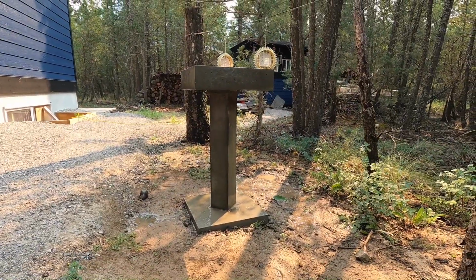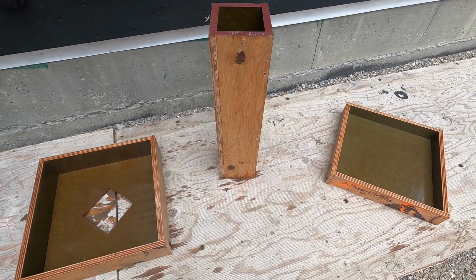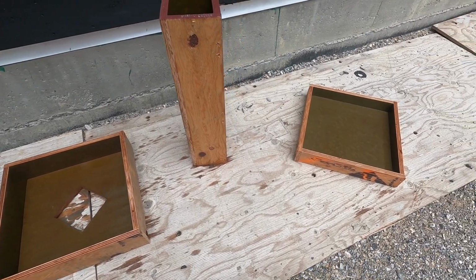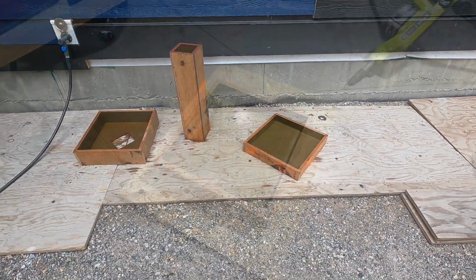Let's get started. Using the cutting list, cut your pieces of plywood and oil the plywood with some vegetable oil so the forms will release when stripping. Use 1.5-inch screws to build the 3 forms. Chase the corners when assembling.